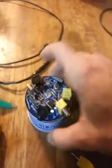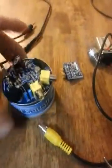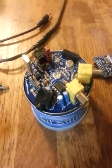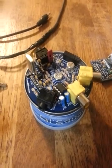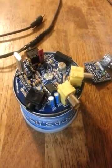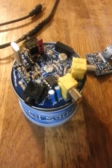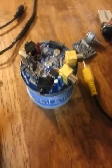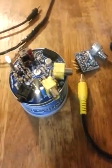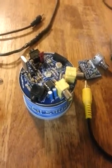It's got some mods you can experiment with — parts I haven't even put on yet. It's a basic rig that runs on nine to twelve volts; a nine-volt battery is probably the bottom range. When you plug it in, you don't hear the noise you'd hear on an expensive rig — just a little bit of hiss. If you listen carefully, you'll hear code all over the place because it's a simple rig without filters, so you'll hear a lot of faint signals at once.